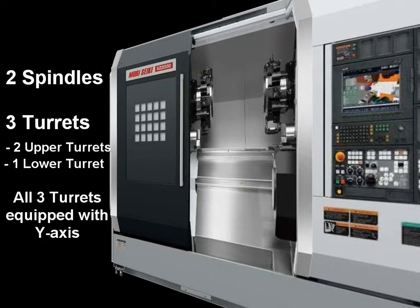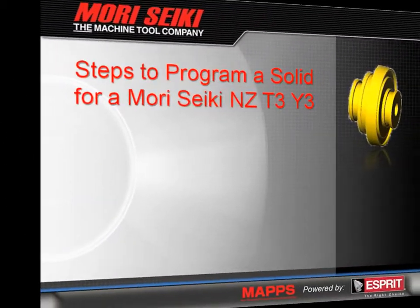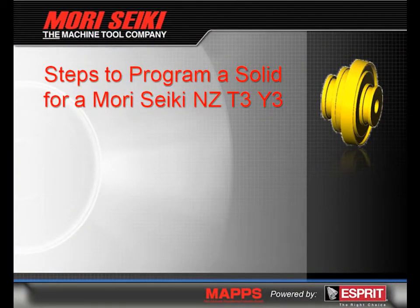T3Y3 machine, which consists of two spindles, three turrets, two upper turrets, and one lower turret. The lower turret can be shared by both the main spindle and the sub-spindle, and all three turrets are equipped with Y-axis capabilities. So let's see the steps that we're going to need to program this solid, or any solid inside the Esprit software, in a simple three-step process.